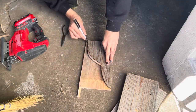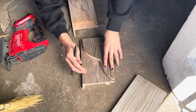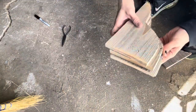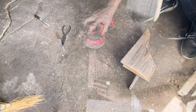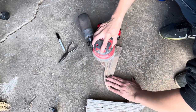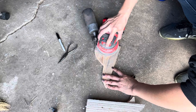Here I am drawing a corbel shape onto those cedar fence boards. I cut out one and then used it as a stencil to make my other three shapes. Cut all of those out with my jigsaw, and then I actually decided to use two of each. I liked how they were each different and made different looks on the windows. I did sand those down with some 220-grit sandpaper to bring out some more of the natural wood colors and help them blend in with the pallet wood a little bit better.